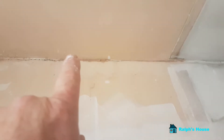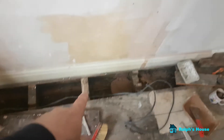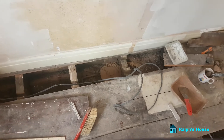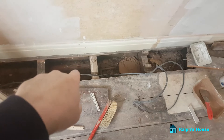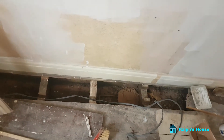I think what has to happen is I drop one cable down, then split it downstairs to power two lights. And if this was downstairs I'm going to have to run around the chimney breast and around the other side. Under 18th edition regulations you can run cables like that as long as they're within — I think it's 150mm — of the ceiling, not the coving. And of course if you put coving over it, it covers it anyway. So I've only got to drop one cable and figure out the join downstairs. I'll run one lighting cable down to the light fitting, up, and then round — that's the way to do it.